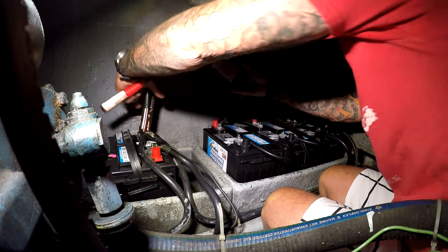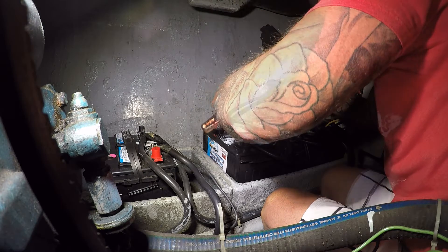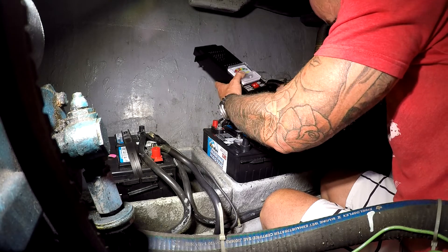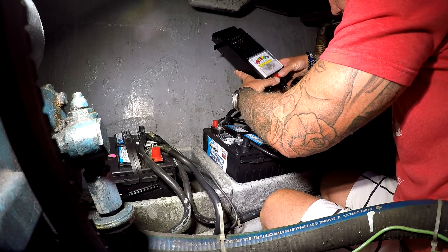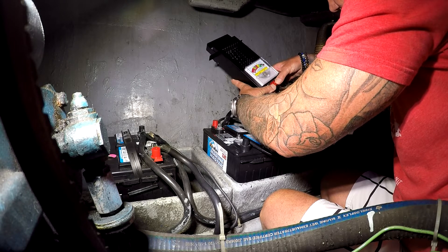About 200. I suspect they're all going to be like that. That's a little better. Okay, so as I suspected, they're running about — let me get this out. Big warning on the instructions: don't touch the housing, it will be hot — they're right. It's good to know the instructions are right. So it looks like they're hitting 400 cold cranking amps.